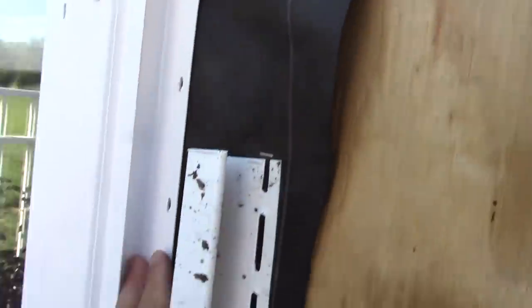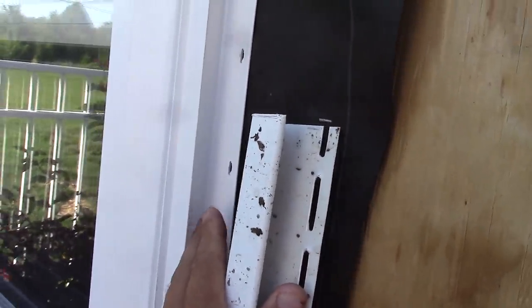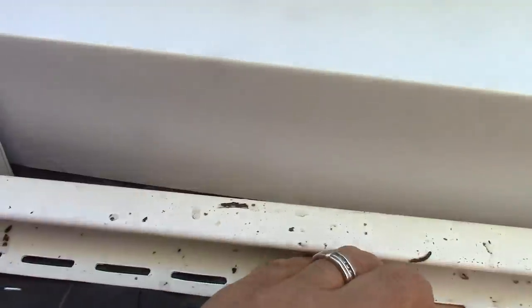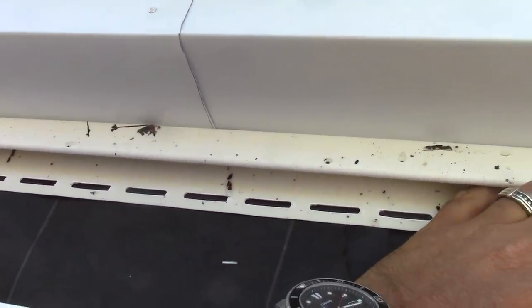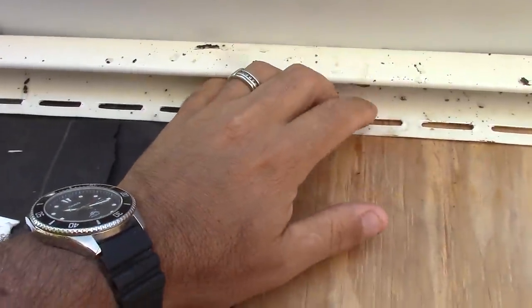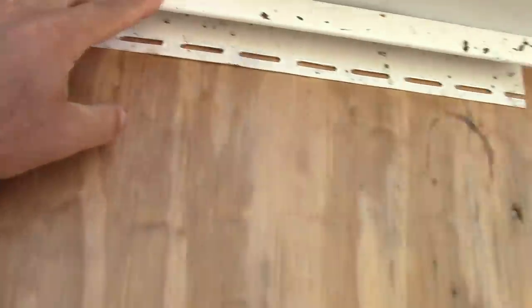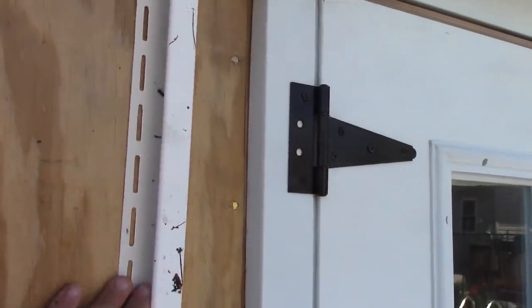Here's a piece of J-channel — a little dirty, it rained last night. This window has the built-in J-channel so your vinyl will slide right in there. We're also going to use J-channel to help hold up the soffit. Once it gets leveled and pushed up there it looks really nice and neat, and your siding gets cut and fits right in at the top.